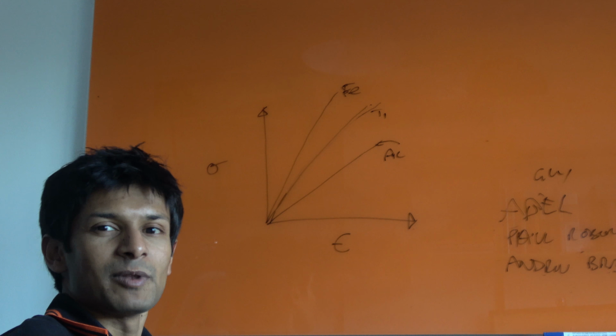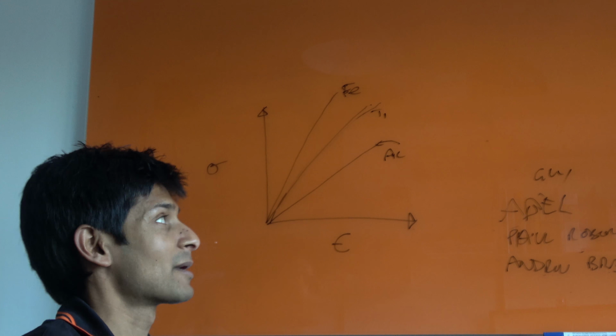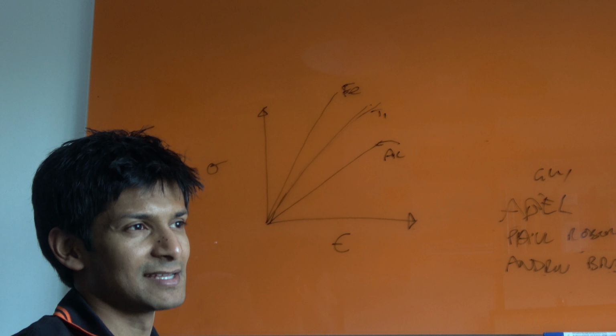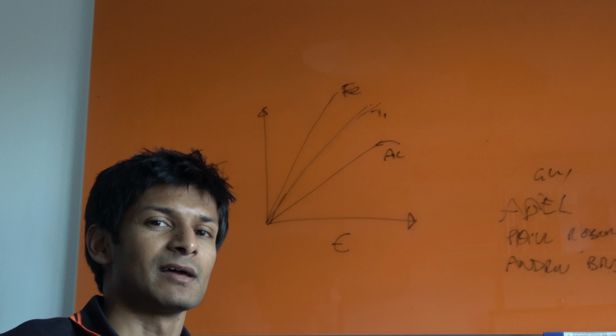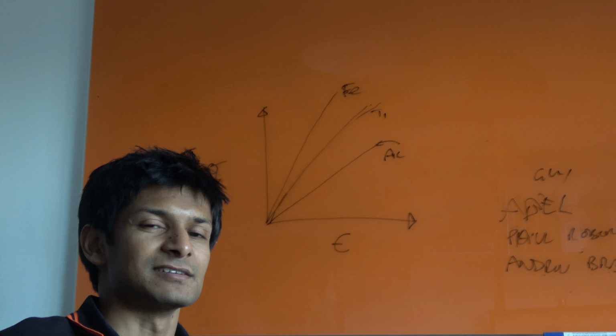Aluminium, you don't have to apply that much force to it to make it move. At the other end of the spectrum, steel, so what Praxis make their bottom brackets out of, is very, very stiff. You're obviously paying a weight penalty. In between is titanium. Now, titanium is probably the ultimate material for a bottom bracket. It's got a very good strength to weight ratio, and it has a decent Young's modulus.